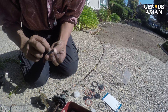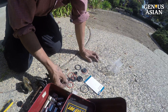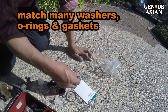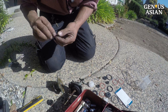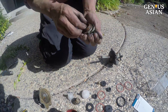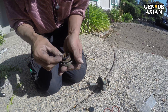As you lay them down, you also need to look at the pieces in the kit and try to match the old part with the new one of the same size. After you've matched up all the old pieces with the new ones, reassemble the valve using the new washers, O-rings, and other pieces from the kit, piece by piece.